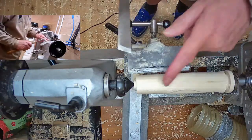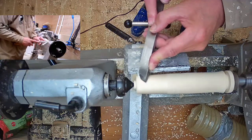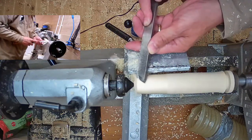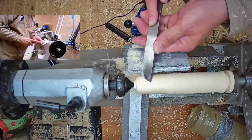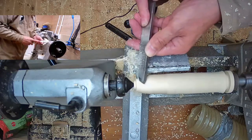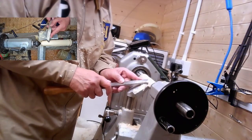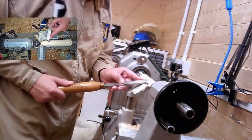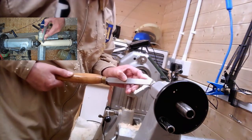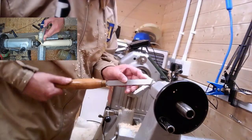Now let's have a go at shaping. Basically a honey dipper is rounded at the end, so just pick it up and roll - it's just like turning a bead. Roll it over so flat, then start to twist the handle so it goes more towards the base or the short point. Pick it up, slide along, and twist. Going to the side camera so you may be able to see how the handle's coming on. Hold it further down and you may see better. Just pick it up, slide along, and twist - I'm not bothered about shavings building up in front of me.